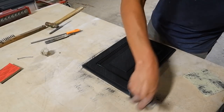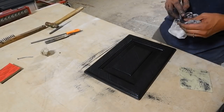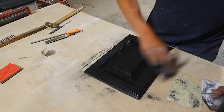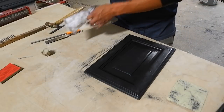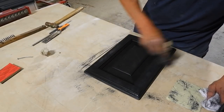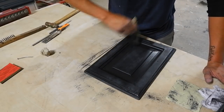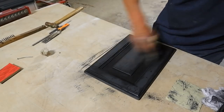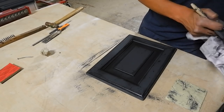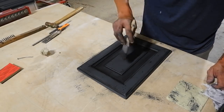The thing with a finish like this — this is more of a furniture finish, honestly. It's a multi-step finish, and a finish like this is going to be pretty hard to replicate over and over again, especially if you're in a small shop or maybe doing it in the customer's house. This is a good upsell for those of you that are painters, cabinet refinishers, or DIYers — maybe this is a good finish to do on like an island where there's not so much surface area. As you can tell, that powder glaze is already starting to dry, and I'm just kind of dry brushing it out — going in different directions gives us a really neat look. I'm going to leave it like that and give it about five minutes to dry thoroughly, and then we'll take it off.